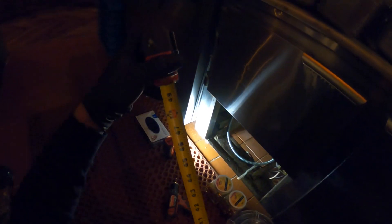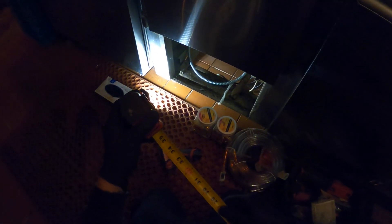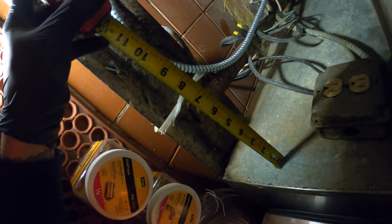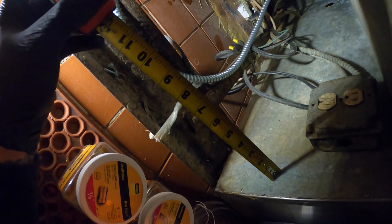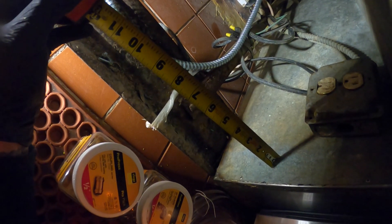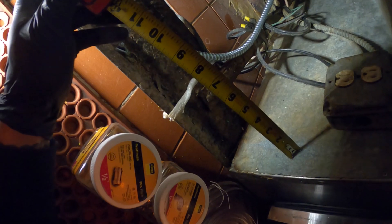How many feet is 55? An extra five inches would make five feet, so that's 55 inches. Then I need about eight more inches for that section. So 55 plus eight is 63 - about 63 inches of straight pipe total. I will also need to add in an elbow and a tee.